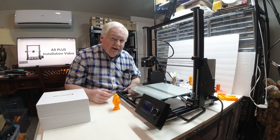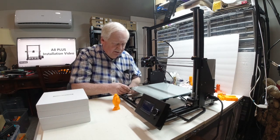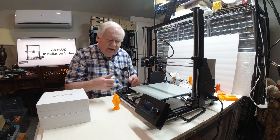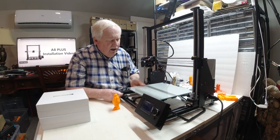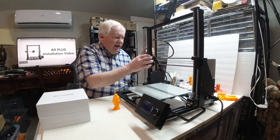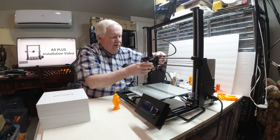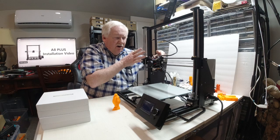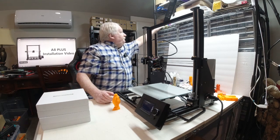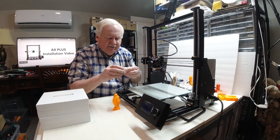The advantage of spending time building these is that — especially for people new to 3D printers — when you assemble from scratch, you learn a lot about them. The assembly instructions were pretty good, showing ways of assembling the bearings and tightening them down after they were in the track. You always want to do that so the bearings, when tightened, are in line with the guide rods they'll be riding on. I also use a little bit of white grease.